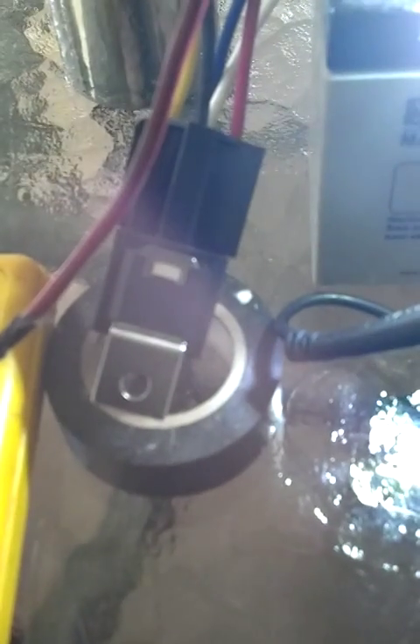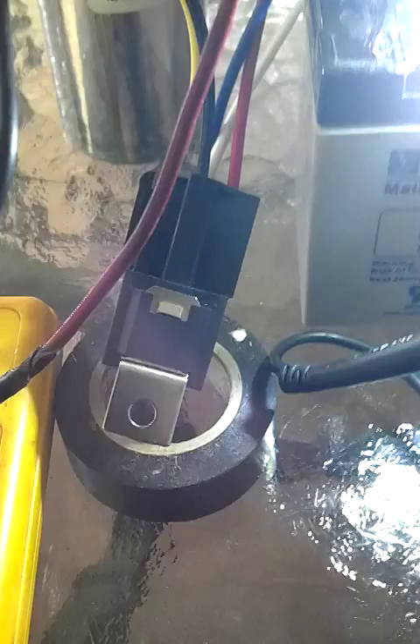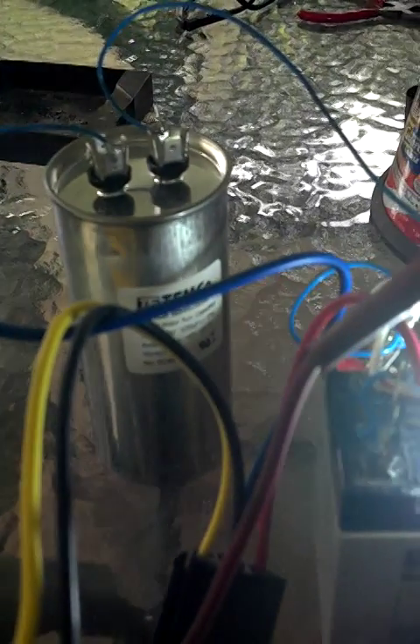I use an automotive relay, but you can do this with any size battery and any size relay, as long as the relay coil can be energized and de-energized by the battery. What happens is the coil inside the relay shuts down instantaneously and turns back on. When it shuts down, there's a back electromagnetic field — an EMF spike. The field collapses upon itself and a high-voltage spike is introduced into the circuit, which charges the capacitor and the battery at the same time.